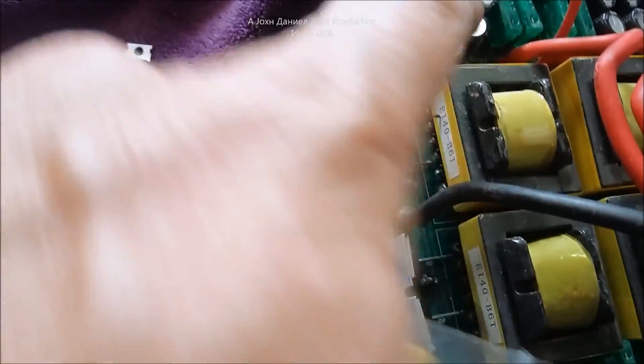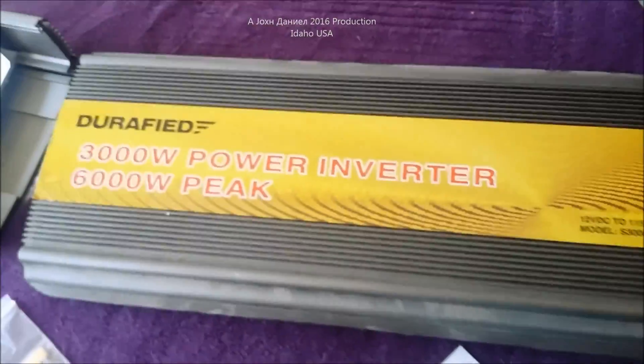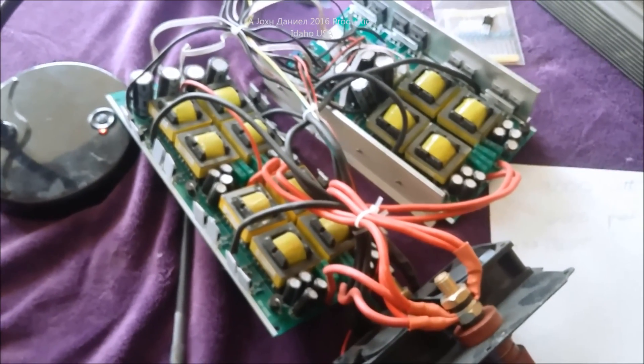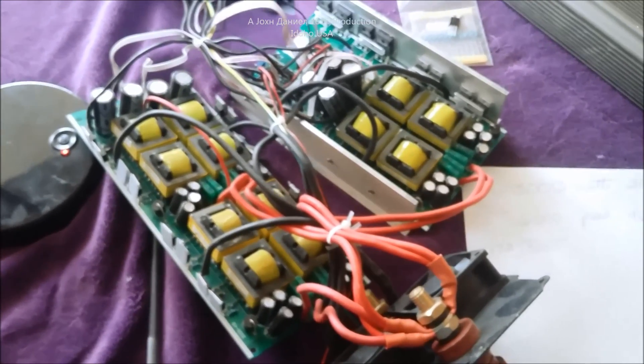All their inverters use the same 10-ohm half-watt resistors to feed power for MOSFET switching — go ahead and get a bag of these. I'll put a link where you can get them. There should really be a repair kit included with these inverters since repairs are basically guaranteed. It's only about 10 bucks — just get it done. Look forward to a repaired, running unit in the next video. This is video one; video two might take a little while as I'm very busy.